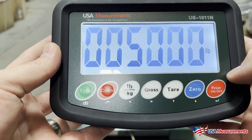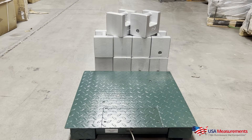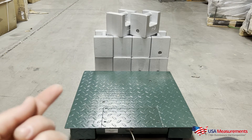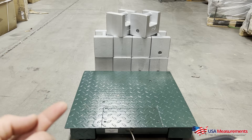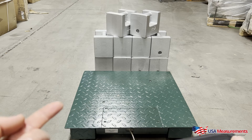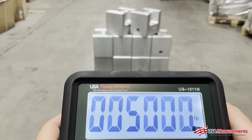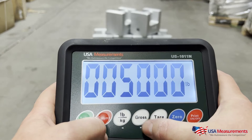This is where you'll be able to set the max capacity of your scale. In this case it's a 5,000 pound scale. If you don't know the capacity, there are a couple of ways to figure it out — there may be a sticker that tells you the capacity, or you can flip the scale over and look at the capacity of the load cells and add them up. Normally, we have 2,500 pound load cells equaling 10,000 pounds, but we set it to 5,000 to give it 100% overload protection. If you want to change this — say your scale is 300 — you would use the gross button to move over to the right.